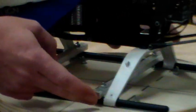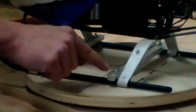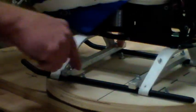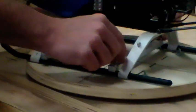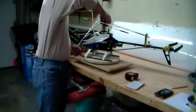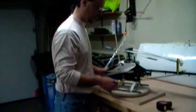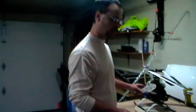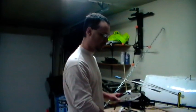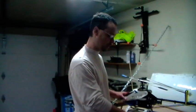To keep my helicopter on the gyro test stand, I had some scrap pieces of aluminum and cut them about a quarter to half inch longer than the width of my landing skids. I drilled a couple holes through the tops, put them on the platform, marked where those holes were, and ran bolts up through so I could tighten them down. The helicopter is on there - it's not coming off. If you're playing around with your gyro settings or rudder, something like this is real cheap to make. You probably don't need the three-quarter inch board - quarter inch would work, just make sure you screw it down.